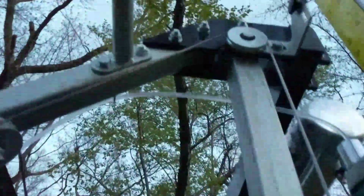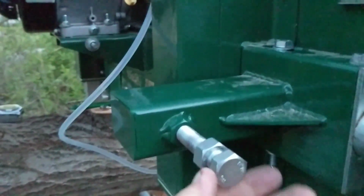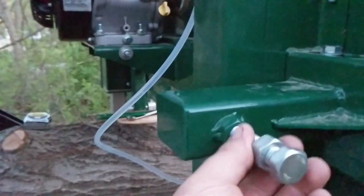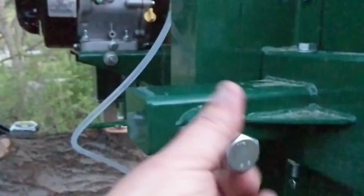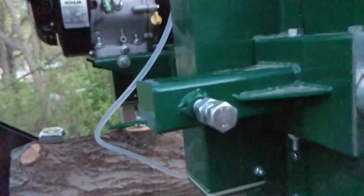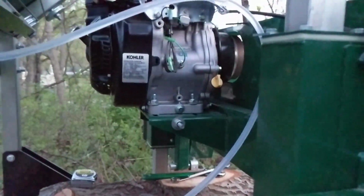See, this thing just pivots. This whole wheel just pivots on this bolt right here. So this never really gets tight. It just lets this arm pivot back and forth, and this rides in a divot. And if it doesn't sit in that divot, you know, it can pop off. That's what they say, and that's what they said was happening. Well, that doesn't happen because I actually tapered mine and it sits inside that bolt. So I replaced this. I've tapered that to sit into the divot. This is loose. My motor's square.